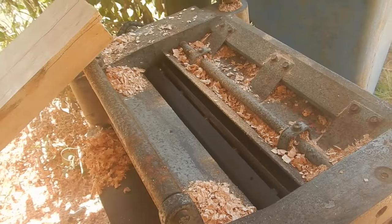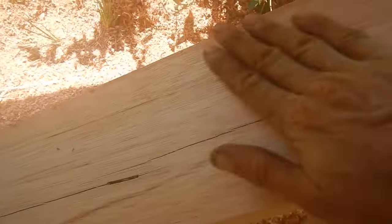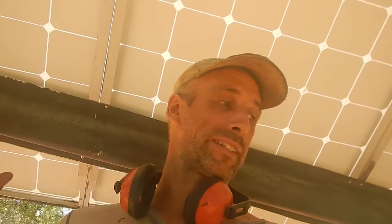Anyway, I couldn't wait, and I already turned it on. And holy crap, so good. Let me just show you for a second. And I'm gonna take 2 millimeters off this. Before, I was only taking 1 millimeter off a board at a time. And sometimes with really wide boards, I'd only take like half, maybe 2/3 of a millimeter off at a time. But I just did like 2 millimeters off this, and it's not even slowing down.